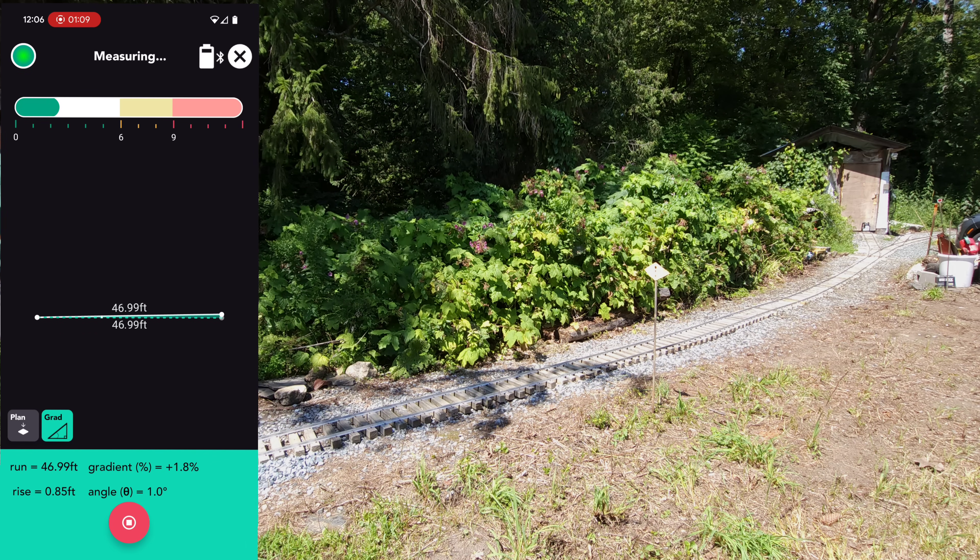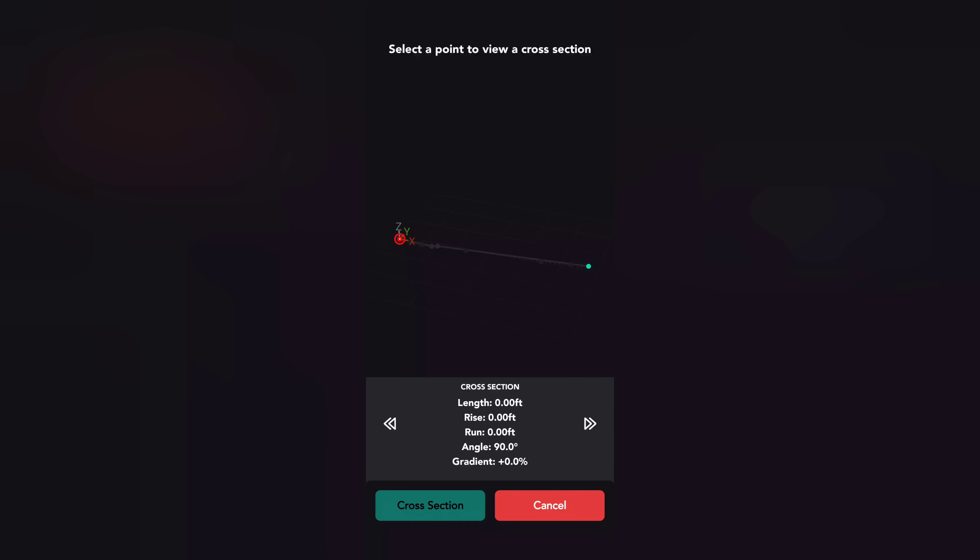Here's the grade profile we're starting with. It starts off with minus 6.5 percent, minus 5.8, minus 2.6, minus 0.2, minus 0.1 percent. Starts climbing again: 0.4, 1.0, 1.1. And that's our base measurement. And that's why I want to raise this dip — over 5 percent. That's just insane.